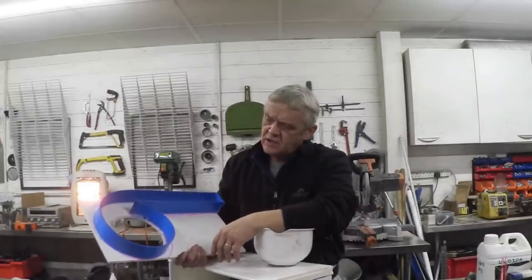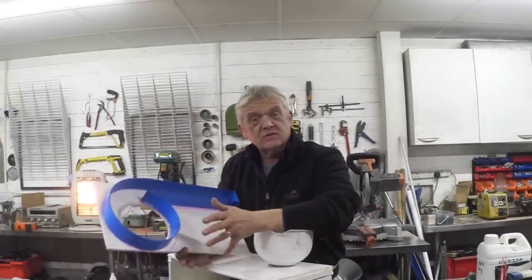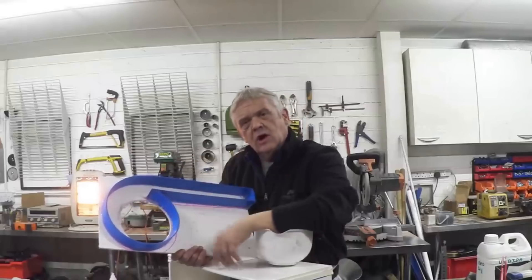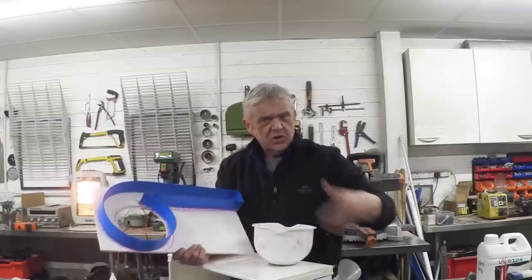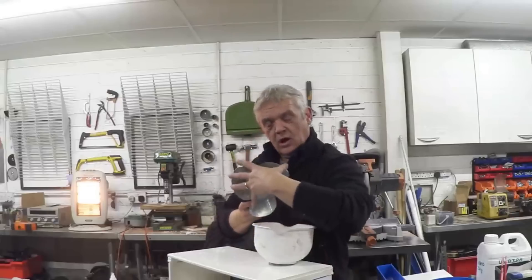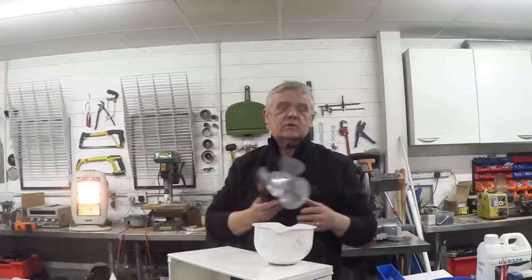When you look at the Belgian design, you notice that the hole that opens up into the turbine is as big as the turbine blades, and that's pretty much what this does — it copies the involute, copies the hole. It makes me wonder: is that hole the right size? Particularly with something like the Rose, could we do better — say if we had a smaller hole? So instead of having the water rushing on here, if we had it coming on at the edge and then having to flow around the blades, would it do any better?